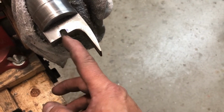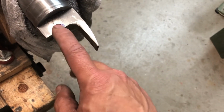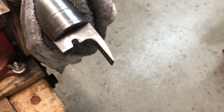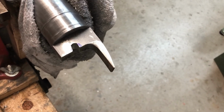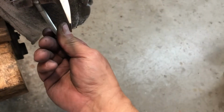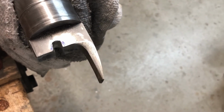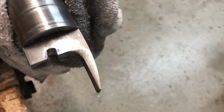Okay, you can see here that I got the notch into the wrench lug here of the breech plug. Now I'm going to go ahead and put it in the barrel, and I'm going to put it in the stock and see how it fits. So stand by. All I did was I just took a round file and just filed it out so that I could make sure that my bolt fit through. So pretty simple operation. Took me about half an hour or so to get it to this point. So I'm going to go ahead and put it in the stock and see how it looks.